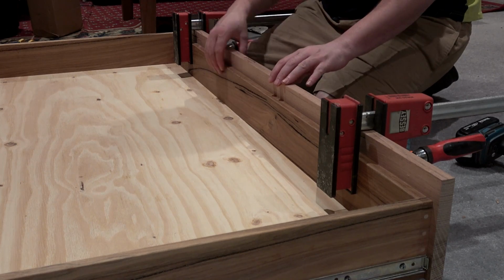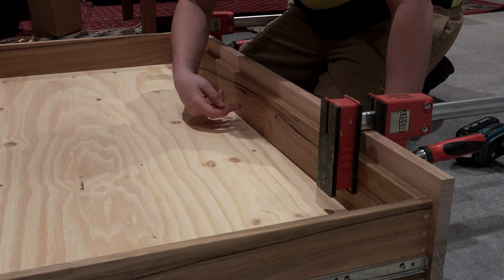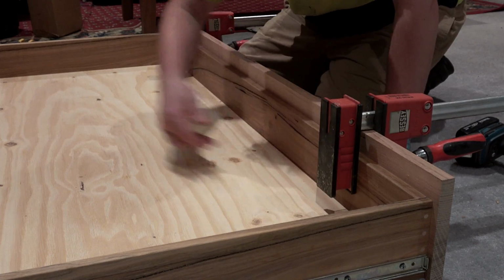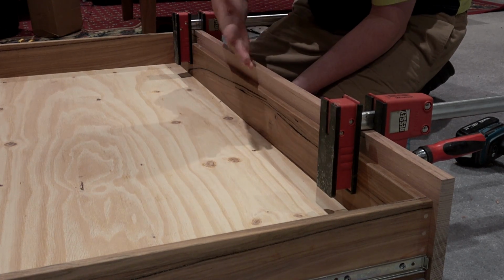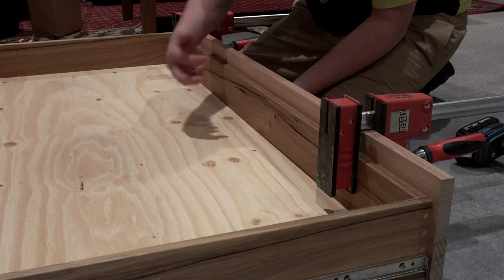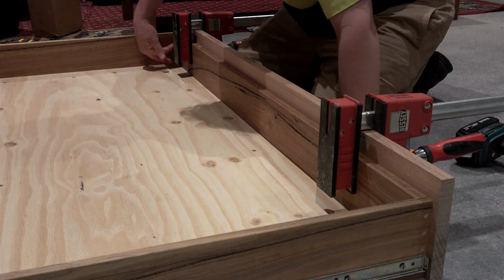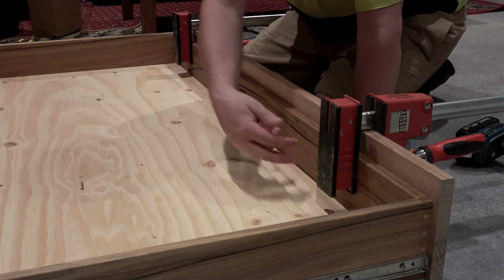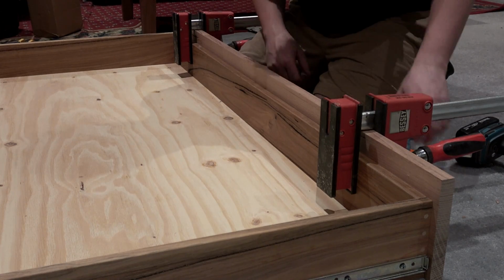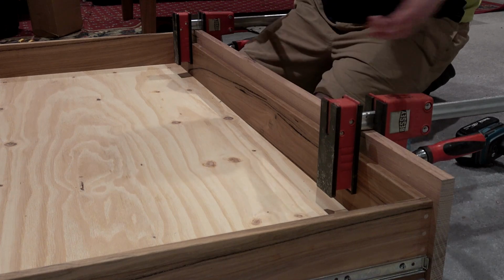So now while the front is held in position with these couple of clamps, I want to put in a couple of screws. I could just do one screw here, and one screw here, but what happens is the front actually gets to flex on that one pivot point. So what I want to do is put two screws here, and two screws here. I might even put 5 sets of 2 screws in there. Haven't decided yet. But for starters, I'm going to put 2 screws in the middle.